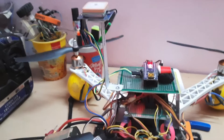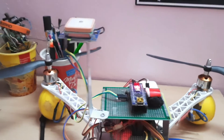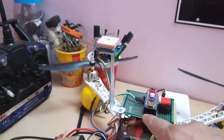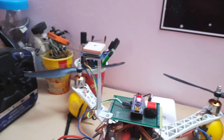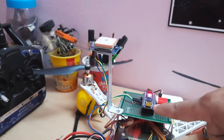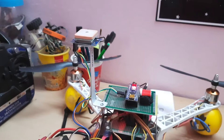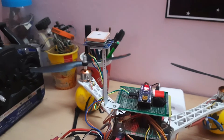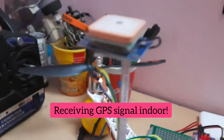I have finally made this configuration for mounting the GPS. Even with the GPS mounted far away from the secondary controller, I still have interference issues indoors, because the GPS satellite signals are quite weak indoors — the noise strength and the signal strength become closer, making it hard for the antenna to get reception. But when I went outdoors, this configuration works perfectly well with no interference, and as you can see right now the light is blinking.